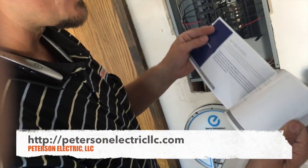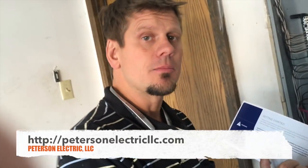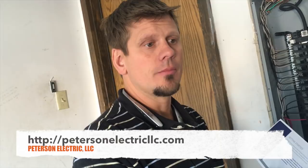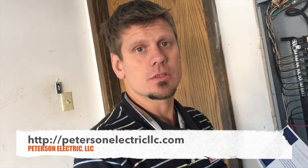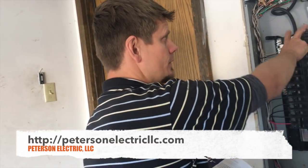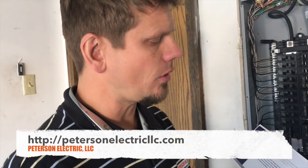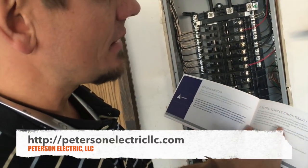The rest of it was pretty generic, but it did say you can do 208 or 240. 208 is going to be a three phase in a building. So if you're a guy who has a shop with a Y system transformer with 208, 120 volt, you're not going to have a 220 to 240 nominal voltage — that's truly going to be 208 to 214, a three phase commercial situation. Running single phase though, only off of two lugs or a two pole breaker to run your car. It won't be three phase in the car, but it would be three phase in the building. They did account for that, so basically it's multi-voltage sensing in the car — it goes in at 240 and does its own inverting inside the car, stepping down to DC voltage, inverting the voltage down to 12 volt. So it's like a transformer and an inverter, but it does say it's single phase.